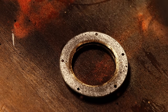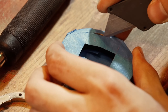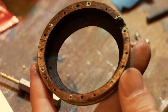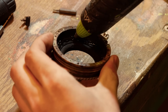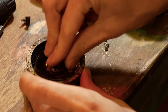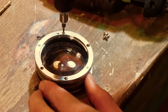My last step before mounting the glass is painting the rear lens mount black. I'm using this Rust-Oleum camouflage paint - it comes out super grainy and dries ultra matte, which is perfect for this application where I'm trying to reduce internal glare. I wasn't happy with how glossy my previous coat of black was, so I'm spray painting the wood part too, which actually turned out really well. Once that dried it was time for the final fitting of the glass element. It kind of hurts me to use hot glue here - I don't like hot glue normally - but hot glue is a decent way to semi-permanently mount that glass so I can take it out later if I want to make adjustments. In the future I'd like to replace it with some kind of rubber gasket that friction fits it in place.